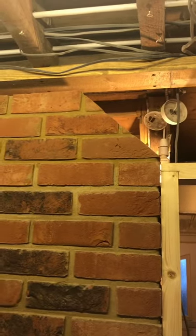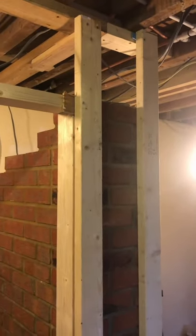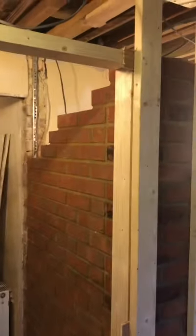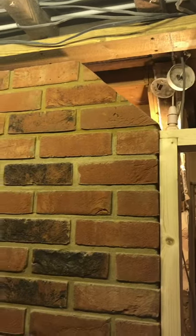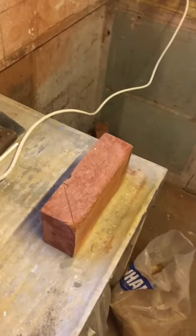So that's the finished product. The pillar wasn't in when I first done that, so I've just built that. These timbers here I've used as profiles to get the mortar lines in the right place, also to hold the door frame in there. Now I'm up to the right level, I'm ready to do exactly the same as I did there, just the other way round — and there's the first brick ready to cut. It works the same on a pillar or a straight wall, same technique.